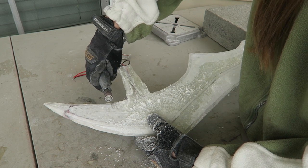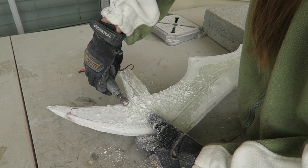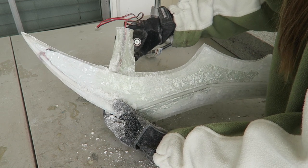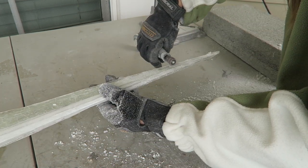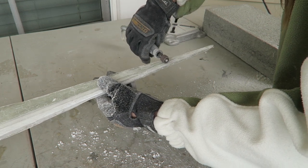Overall it was still pretty rough on the outside, so I think you would need a much thicker fiberglass layer in order to be able to sand it down to a smooth surface that would be ready for carbon fiber to go over top. I was also losing my edges in there — with so many layers of fiberglass it was just hard to see. I probably needed to attach the pattern again and perhaps trace that out.